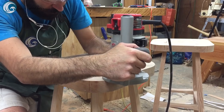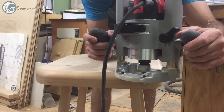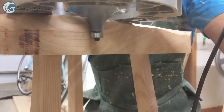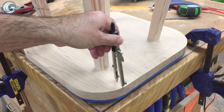Now with a three-quarter inch rounding over bit in the handheld router, I take an initial light pass to remove material and then a final pass to bring the bearing against the surface that was previously routed flat. I then wrap a strip of tape around the stool to mark where the roundover ends on the side. Using a compass set at one inch, I then mark a boundary to designate the shaping location.